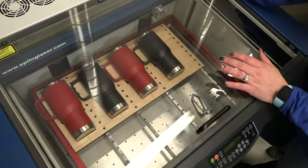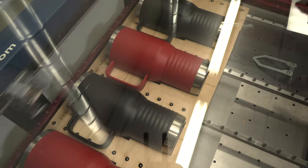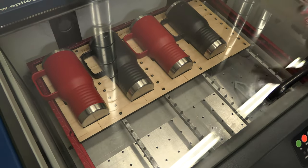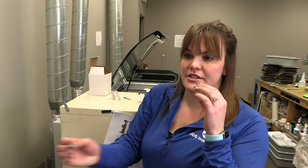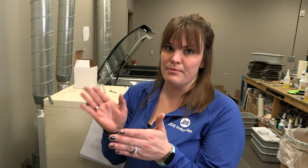With the four inch lens it's going to look like your cups are farther away than normal, and that's so you're able to maximize your space. On our 20 ounce cups, I imported the art at two and an eighth and when it lasers it's going to come out to just short of two and a half. When it's lasering it's essentially falling onto the cup and breaking that radius, getting your max coverage that you can with a stationary cup.